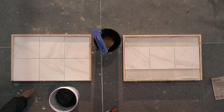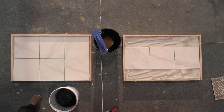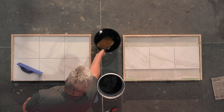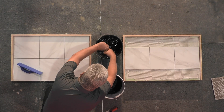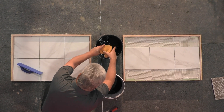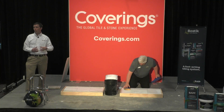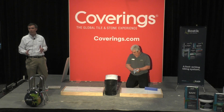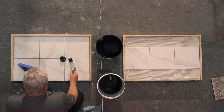The final product in this micro system is our Vivid Grout. With Total Prime, you're saving time by being able to go over difficult-to-bond-to surfaces. With BAM, you have extended workability and a fast curing nature. And then the Vivid Grout is an extremely high-performance cement-based grout. It meets ANSI 118-7, so it does not require a sealer. It's suitable for use in joints anywhere from a sixteenth to a half inch, which fits almost all applications where a traditional sanded or unsanded grout would fit — it's almost an all-in-one.